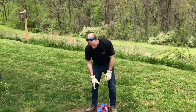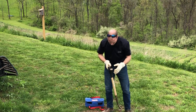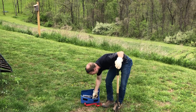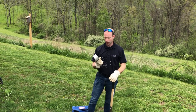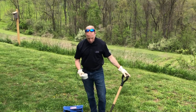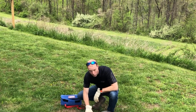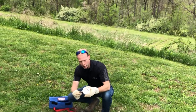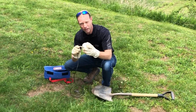I'm going to dig my hole a little bit up here. The Instantel-style sensor is a four-inch puck, so you need to make sure that you dig a hole that's going to be big enough around. The sensor can be pointed at the source, but you're not crimping the strain relief all the way up or all the way down in any direction.